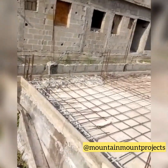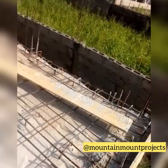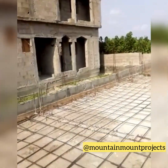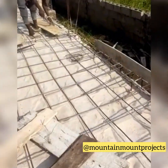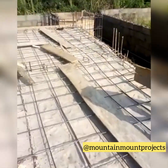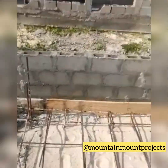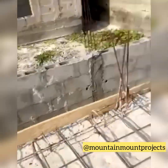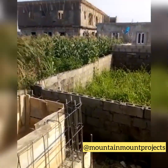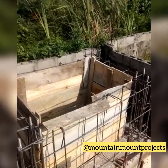As they are pouring the concrete for the German floor, they are also pouring the concrete into the foundation for the tank base. The carpenter is doing his job, putting the planks around because that is the level — it's like a layer of concrete poured on every layer of the foundation. First you construct the foundation, then you fill up the foundation, put the mats, then pour the concrete on top.